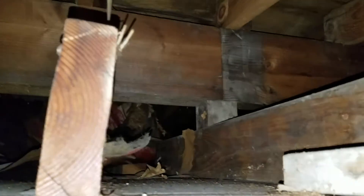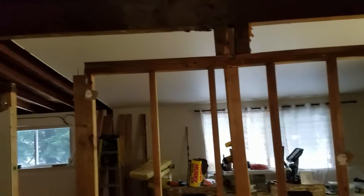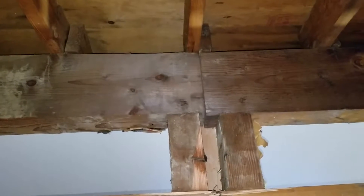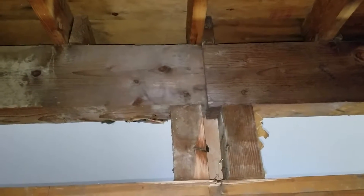Let's see if I can get a better look at that. So that is what we're working on right now. The other thing we have to contend with is there's a break in the beam at the top there, which is not quite center of the span. So we'll discuss if the new doubled-up laminated veneer lumber beams will work, or if we need to do some kind of metal bracketing up there to join the two. Okay, so that is where we are at now.